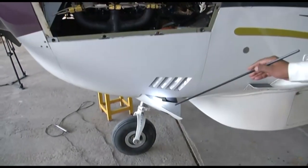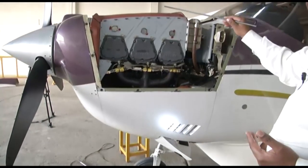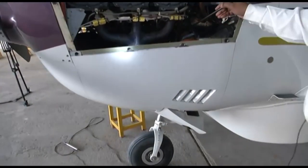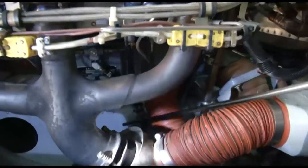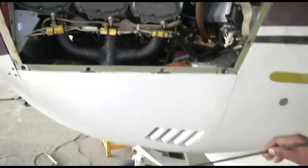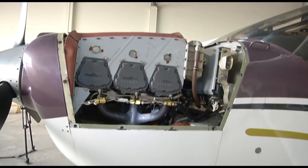These cowl flaps, they help in creating a pressure differential. They in fact add to the pressure differential between the top portion and the lower portion. When the cowl flaps are opened, the pressure is reduced at the bottom portion of the cylinders. This lowering of pressure also further adds to the pressure differential between the top chamber and the lower chamber. These cowl flaps, they also modulate your airflow. So this is how your air cooling is taking place in this engine.